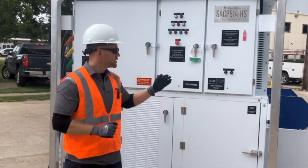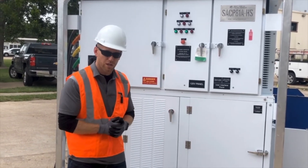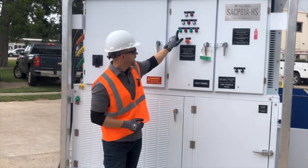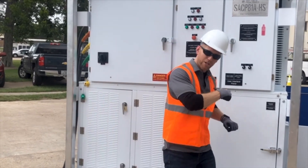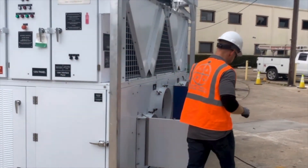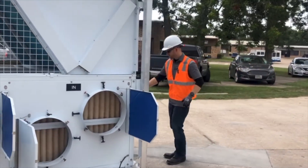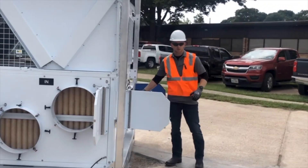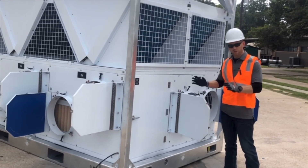Depending upon the location of my speed pot and how much airflow I'm running through the machine — I now have both compressor one and compressor two running with no trips on the machine. I'm going to go check the outlet air temperature. I can already feel my outlet air temp is nice and cold and we're great.